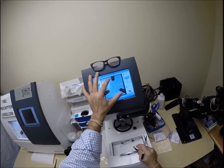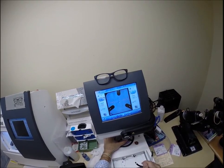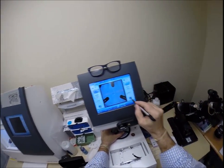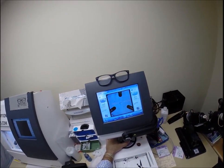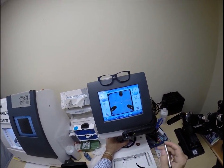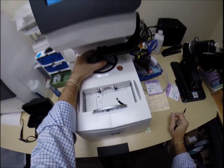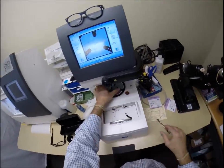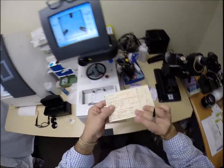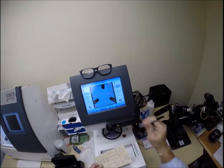The reason why I put those three dots on there is it lines it up in there perfectly. Place that there — it tells me that the lens is oriented perfectly. I want to check one thing: make sure the lens is large enough to fit into the frame. Go ahead and hit that button. The arm comes down and places the block onto the right lens. We're going to do the same thing now for the left lens. Your pupillary distance for the left lens is the same as the right — it has mirrored the right, coming up at 34.